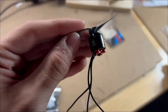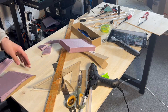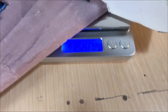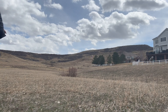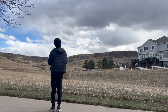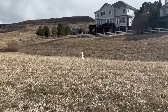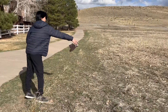With that in mind I went ahead and got the super tiny 1108 5000KV motor. It might have actually been too small for my application, but I just wanted to see if I could get better results. Instead of using regular foam board I decided to hot-wire some wings out of insulation foam to get a more accurate airflow profile and to make the whole craft really light. After finishing, the weight came out to about 155 grams, but even with these modifications it still didn't fly any better. Most of the time it would fly fine after I threw it, but right as I put my hands back on the controls it would spiral down to the ground.